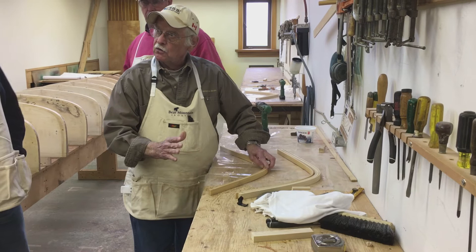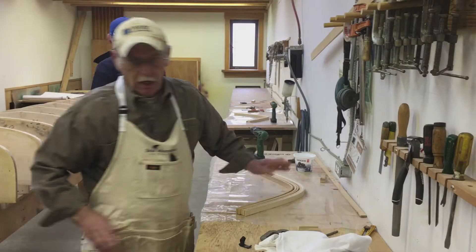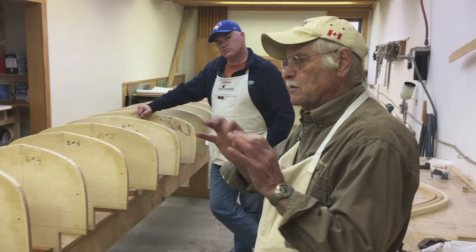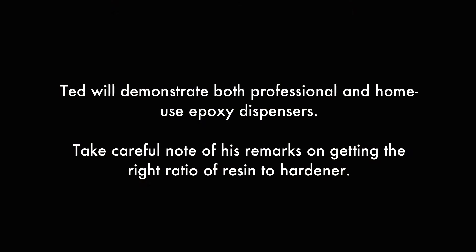You're going to put the glue on all of the mating surfaces — none between these two. I'm trying to picture the space that the glue's been occupying, plus a little bit more to soak in. So that means if you pile a whole lot on, it's not going to make it a stronger joint — it's going to squeeze up.